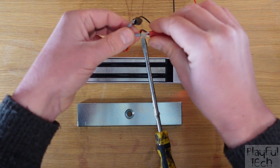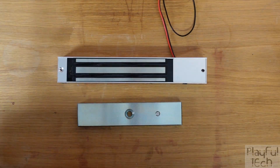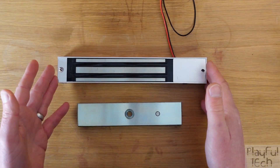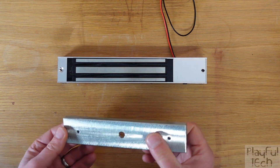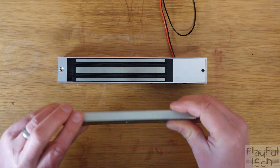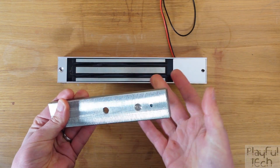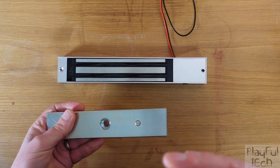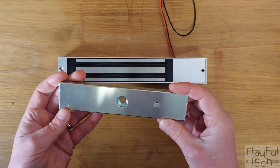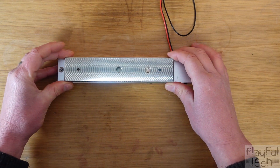And when I cut the power, you'll see the magnetic field stops. The way to install a mag lock like this is that the mag lock itself remains stationary and you attach it to the frame of the door. Then on the door itself, you install this metal plate known as an armature plate, and you want to position this so that it touches this part of the mag lock when the door is closed. One mistake people sometimes make when installing the armature plate is to fasten it too securely to the door. You actually want to screw it in so that it has a little bit of play, a little bit of wiggle room, so that when it comes close to the mag lock, it's able to snap flush into position like this.